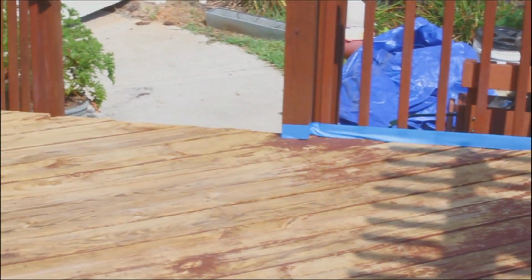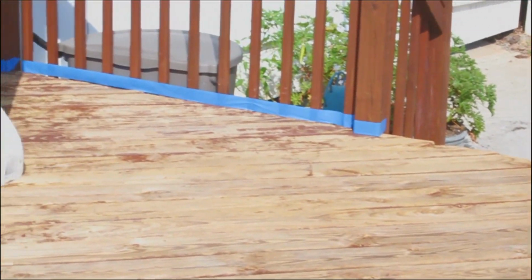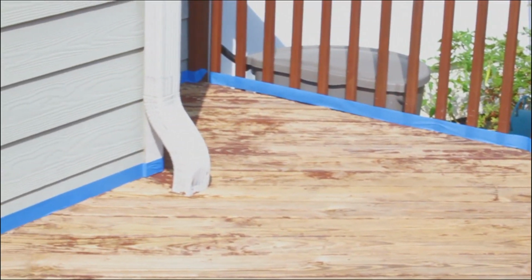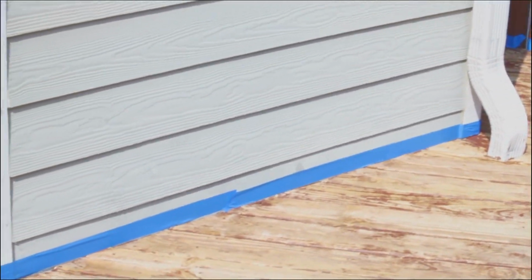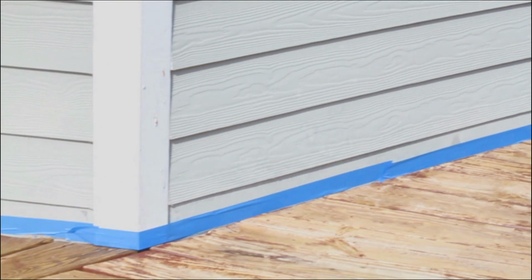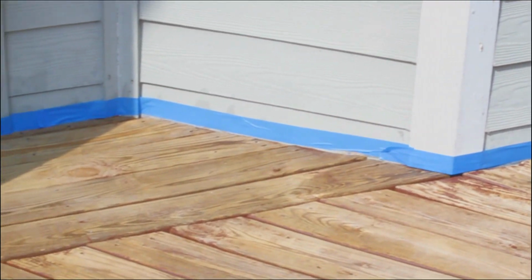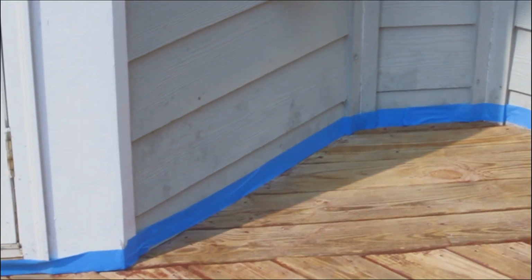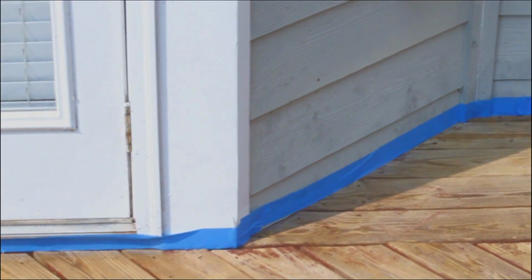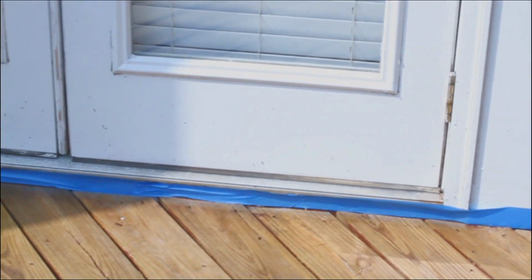Before your project begins, it is very important to ensure that the wood is cleaned and prepared correctly. This deck was thoroughly pressure washed after a solid color stain was removed. The goal is to have a clean, dry surface that has been dulled from any previous treatment. Rusted nail heads and fasteners must also be treated with a rust inhibitor found at your local hardware store. You can read more about how to correctly clean and prepare your deck at Encore Coating's FAQ page.